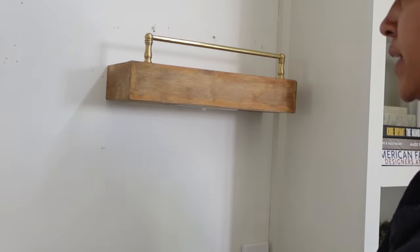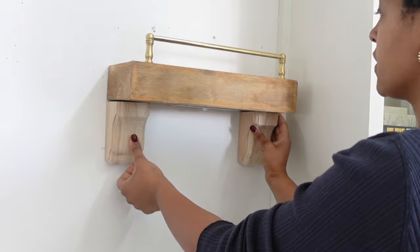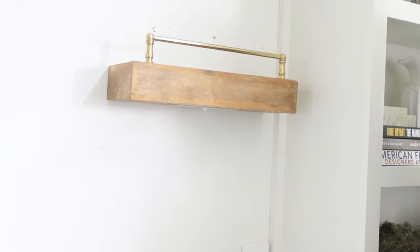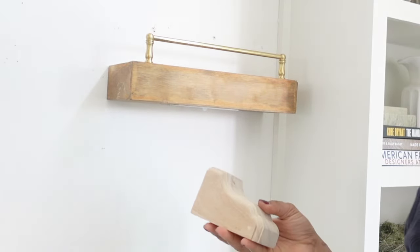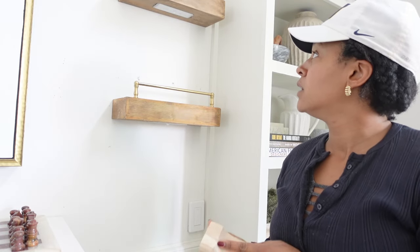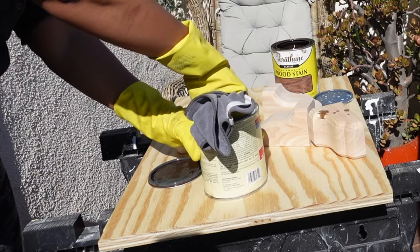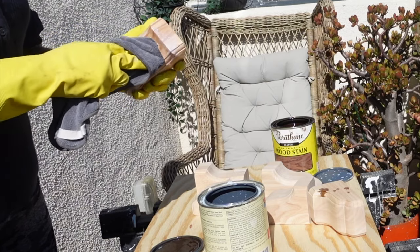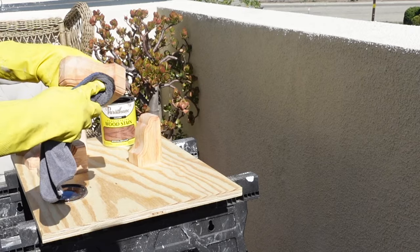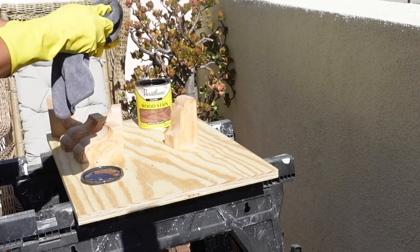With the corbel in place I do think that would look nice, and I think it would soften the shelves a little bit. At first I was thinking maybe brass brackets, but I kind of like these — they're different and the rounded edge will soften the shelves. I'm going to stain these: wood condition and stain them the same color as the shelves. Anytime you're staining something it's really important to wood condition first — you can avoid getting splotches or inconsistencies in the wood. The wood conditioner just preps everything to ensure the stain goes on very smooth. I use Minwax pre-stain wood conditioner, then the same Special Walnut by Varathane to match the shelves.